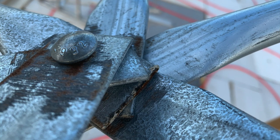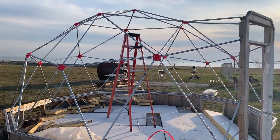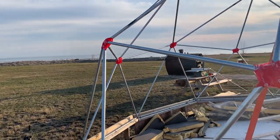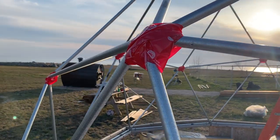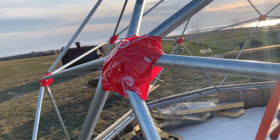The first thing you got to worry about when putting plastic on a metal conduit dome is sharp edges. The solution? Tuck tape. I tape the bejeebers out of every single joint so that nothing on the joint will catch the plastic. It's pretty simple to do. Tape's cheap and it seems to work.